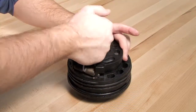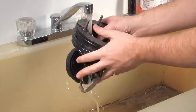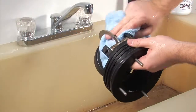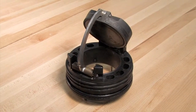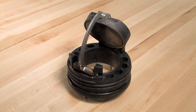Checks found in the 2.5 to 4-inch modules can be opened by hand. Begin your inspection by cleaning the check module with water to remove any dirt or debris. Once cleaned, thoroughly dry the module before proceeding with the inspection. In many cases, damage or deeply embedded debris may be invisible to the naked eye and can only be detected by close examination and touch.